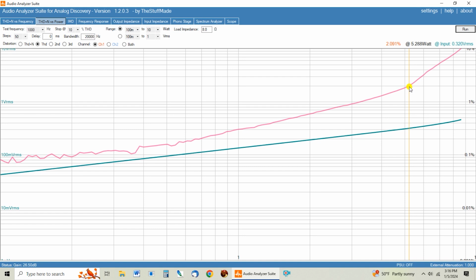What we've probably got going on is, given that these are like the real OG type 300B tubes, they've got the rated Miller capacitance that these tubes are known for, and these are really hard tubes to drive. And the front end of this Willsenton amp just is not able to supply enough current, or oomph, whatever you want to call it, to actually drive a real pair of 300B tubes. So before we get into looking at that, let's make a note here that around 3.2 volts input, on the upper right of the screen, is where this line starts turning up quicker.